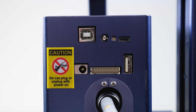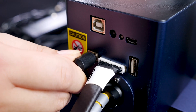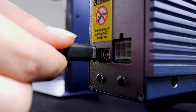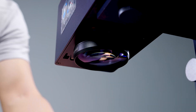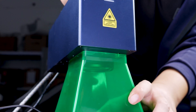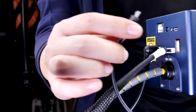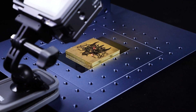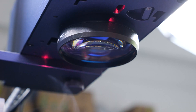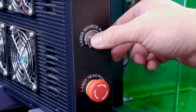Take a look at all the ports on the G2. Start by connecting the main engine to the laser source module, then connect the power cable. Link the lifting stand to the laser source and remove the lens cap from the main engine. At this point, you can choose to install the protective shield — it's always recommended when engraving. Finally, rotate the emergency button and press the power button to turn on the machine. Now you are ready to go.